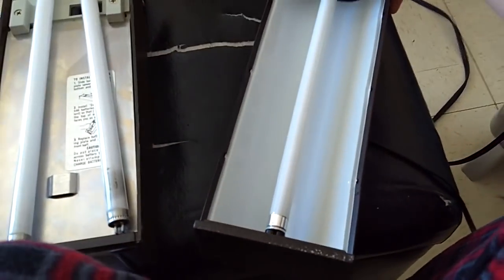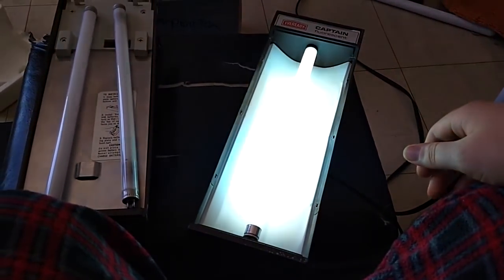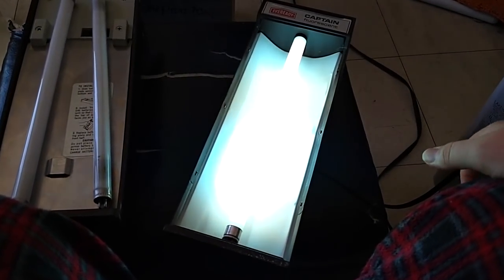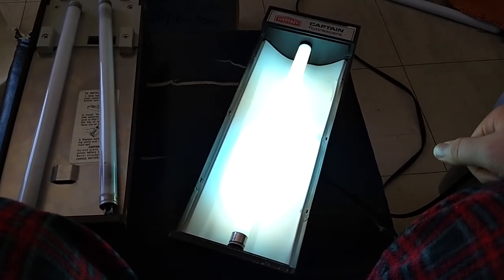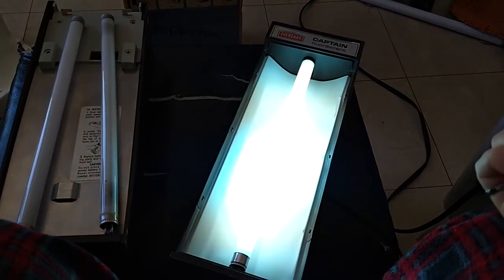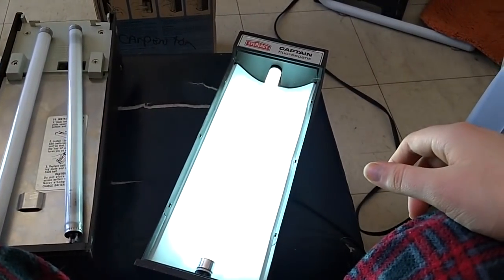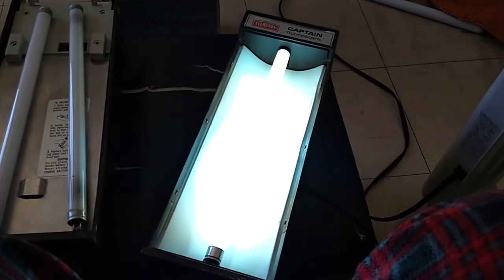See what this is. It's daylight. Oh, I know where this came from. This came out of a really cheap one of those battery-powered 8AA fluorescent closet lights. I found it at a restore quite a while ago. Brand new in the package, if I remember right. And yeah, I bought it just because it was there and it was cheap. And also, it's one of the few of those cheap closet lights that has a little barrel plug on it, so you don't have to run on batteries. You can run on a barrel jack, but nothing special otherwise, just a standard crappy instant start ballast.